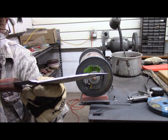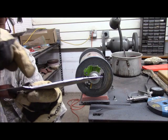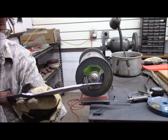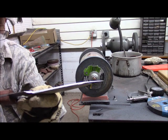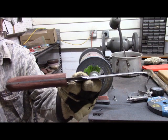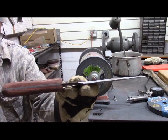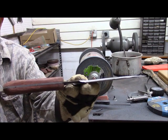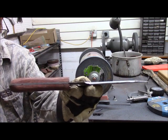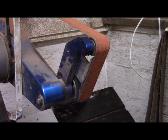And now we're going to put it on our knife making machine and take care of this rough this here, and also do a little more smoothing, and then tackle the real problems of trying to take off these scales without destroying them, and I would give our chances of success at only about 20% at best. We're going to see if we can use that small rounded wheel at the top to actually make the bevel on the blade between the handle and the knife.